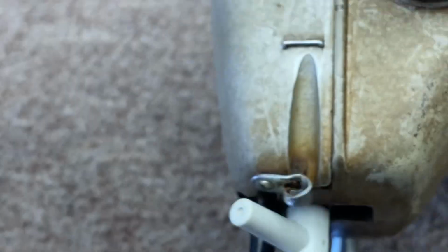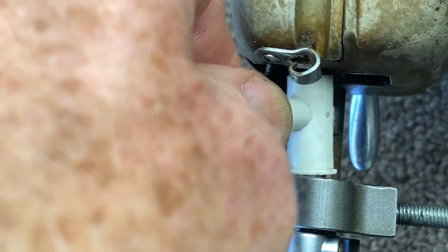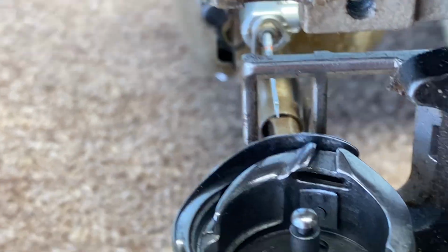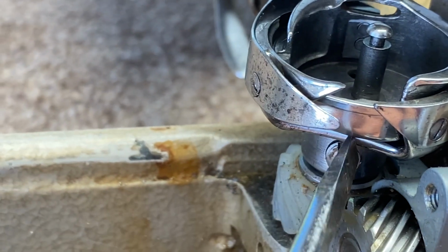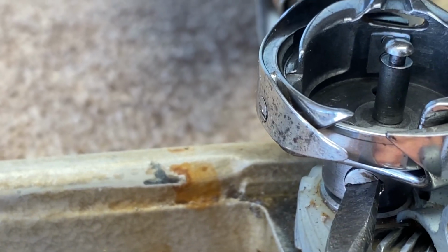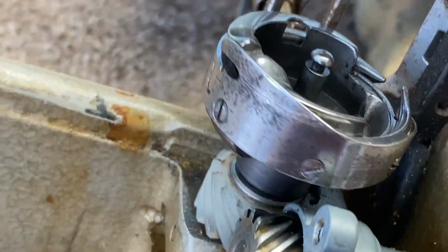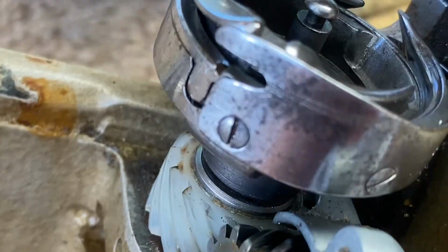Then, once you've got that, you can take out your spacer or whatever means you've used to set the timing, and then turn your hook until the other screw, find my other screwdriver. That one was loose. And then I'm going to snug it up, and I'll just turn this one back around, tighten up the other one, and then you can put it all back together.